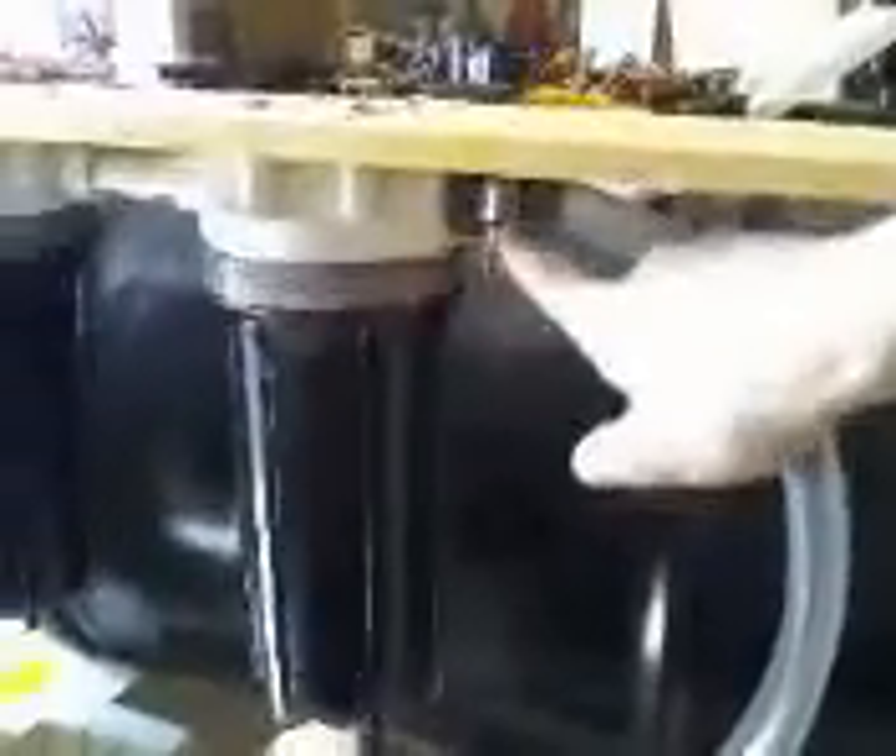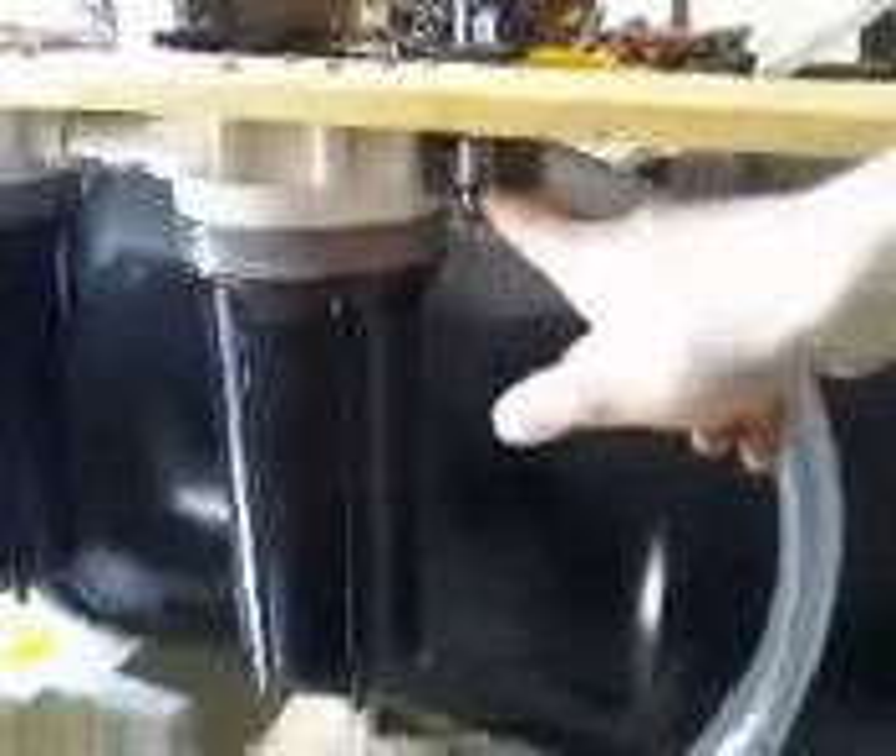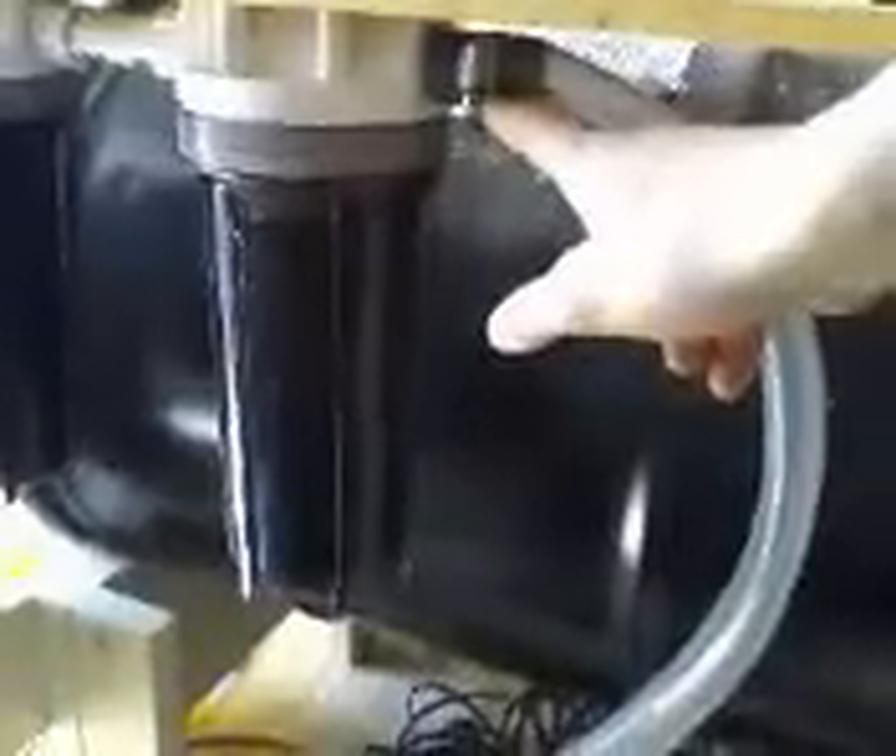Here's the setup. There's my barrel. My hose comes out down there, runs over to my pump, and then from there it goes up. You can see I've got my filters, and then it goes out the front. Last night this joint right here came undone because I didn't have hose clamps on. It was very bad news — oil spraying, and not good.